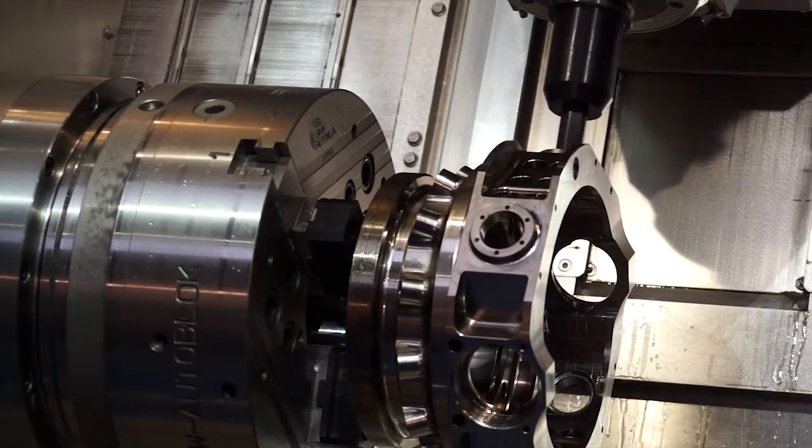Let's drill into the detail on the interesting bit — the axes. You've got a B-axis head and a tool changer at the back of the machine? Correct, yeah. Much the same as the bigger machines, you've got the B-axis on the head, the milling head. On this particular one, it would be either the Capto C6 or HSK 63 milling spindle.